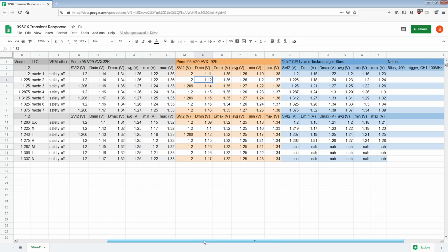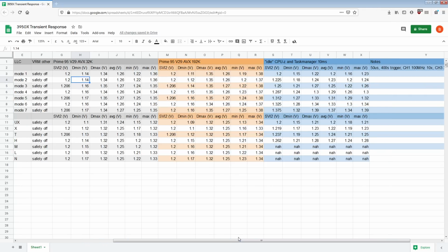It's kind of surprising that 32K didn't show one, but at the same time, the thing is, 10 millivolts, with rounding, I wish my oscilloscope had a third digit. It doesn't measure to four digits for measurements. It'll happily show you 999 millivolts, but it will not show you 1.001. I'm pretty sure it's just a software restriction, but oh well, that's what I get for having a cheap scope.